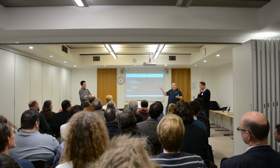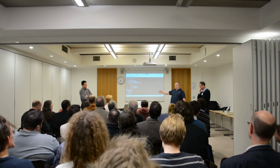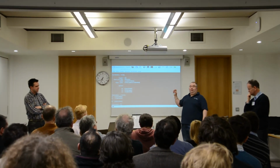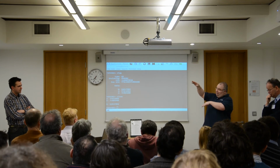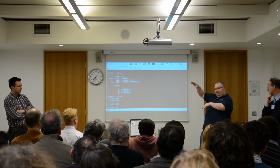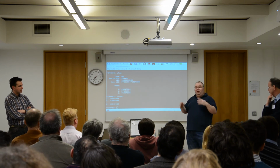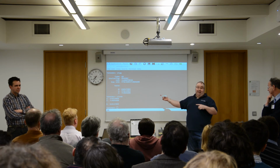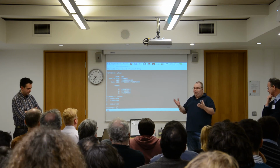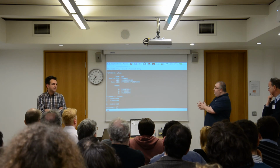The hardware wiring that comes out of the back of the reader uses the same Wiegand style signaling, which is 2 lines. You get a dip on one for a 1 and a dip on the other for a 0. No encryption. Even if you have a high security reader, you've still got plain text coming out the back. So when you actually delve into this stuff, it really makes you want to cry.